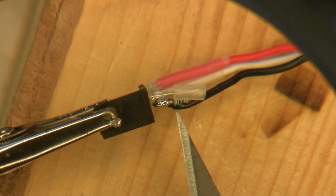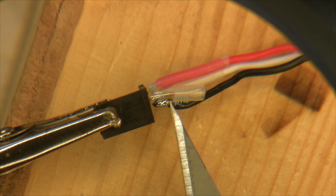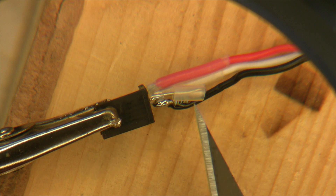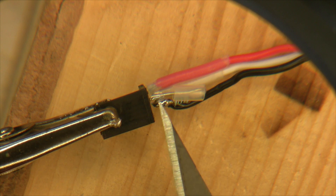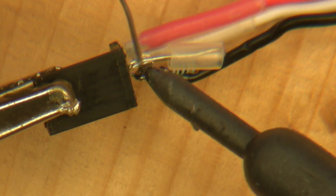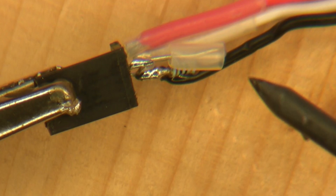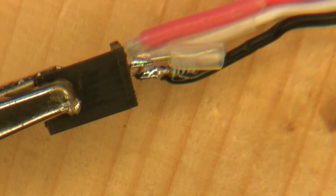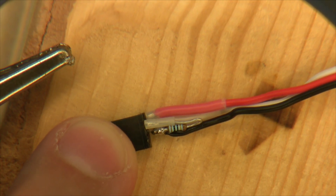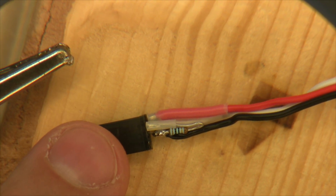I've taken the resistor wire and wrapped it around to come back again and hit this ID pin. I put a little tiny piece of shrink wrapping over it, and what I'm going to do is after I get this soldered nice and tight, I'm just going to slide this down and protect it from touching the ground wire. Here's what it looks like after I put the shrink tubing back down again and kind of tightened up the resistor wire — it looks pretty nice and tight and all my solder connections are very solid.